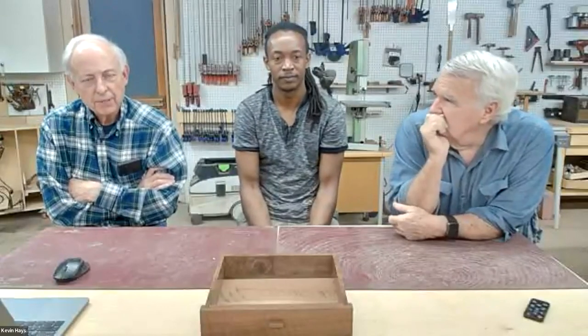Normally, if you buy lumber in the rough, 8/4 lumber is a full 2 inches thick. Now, if you want 2 inches thick, you'd have to buy 10/4 lumber and mill it down to 2 inches thick.